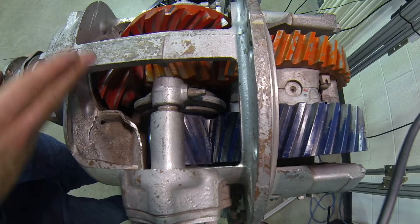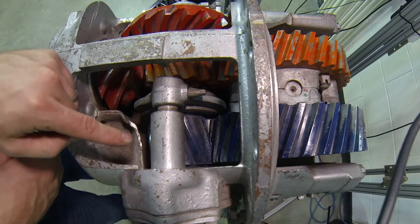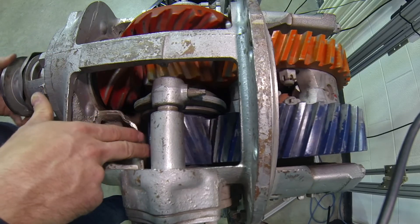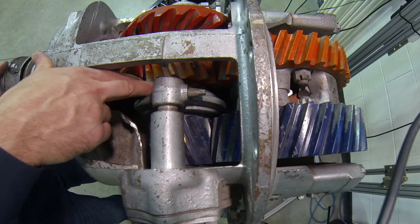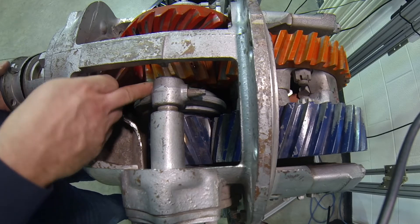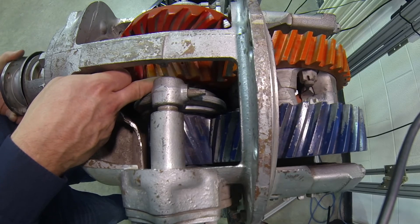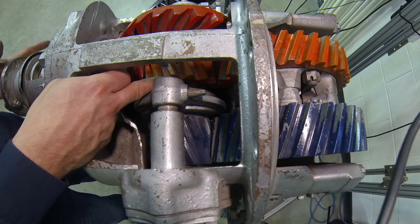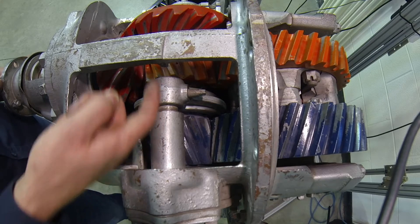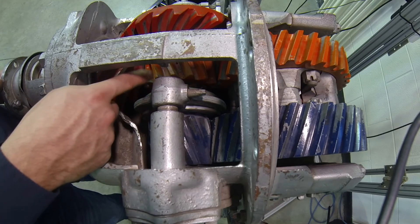The path of power goes from pinion to bevel gear. The bevel gear drives the cross shaft, and the cross shaft itself floats inside the drive gears. What locks the two together is a center shift fork that moves a sliding collar and a sliding clutch, locking a collar on the cross shaft to the dog teeth on the individual gears themselves. That's how we put it into gear. As air from the diaphragm moves the fork, it's able to select either low — where it is right now — or move forward to go into high.